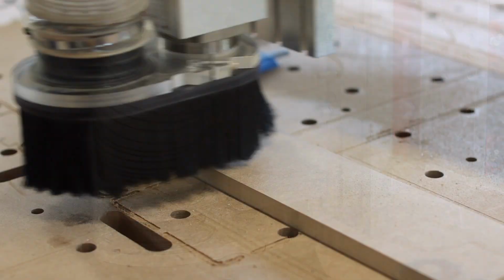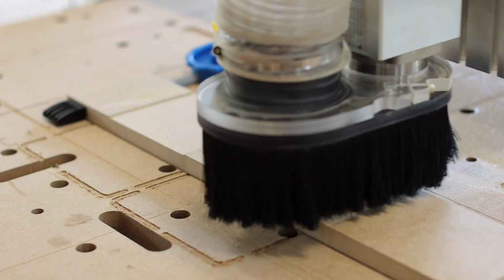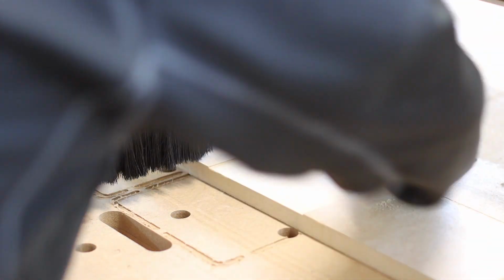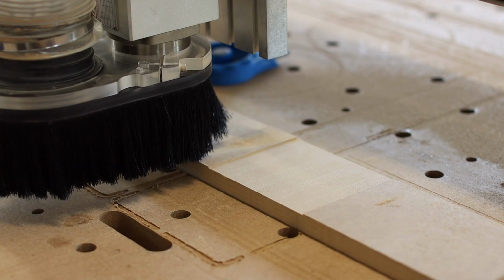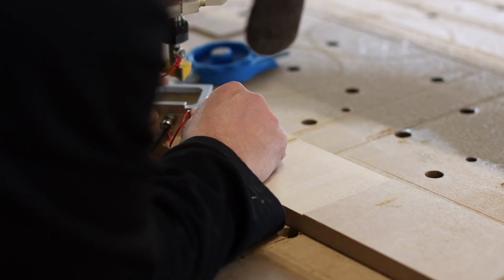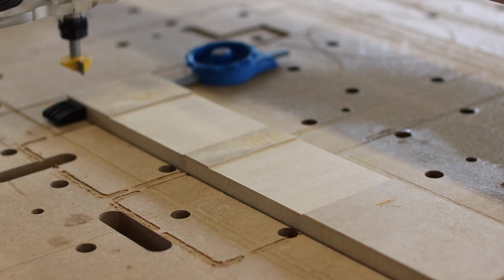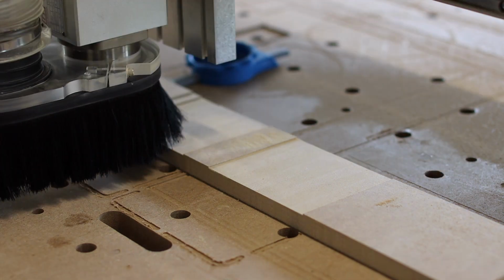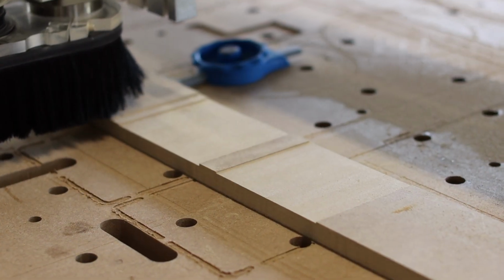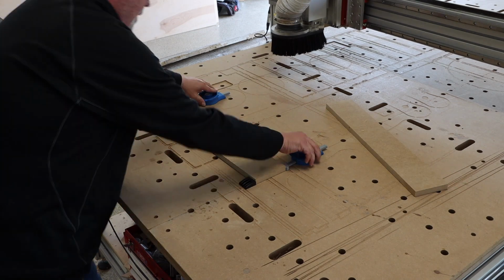And I will simply move my starting point over about 4 inches and rerun that test program. On the first adjustment, I had intentionally overcorrected, and now I had some idea as to where that middle ground would be. So I go back to the original starting position, refine Z, and rerun that test program one more time. And third time's a charm. After this third pass, I could still barely see lines, but I could not feel them. And that's about as good as I can get manually.